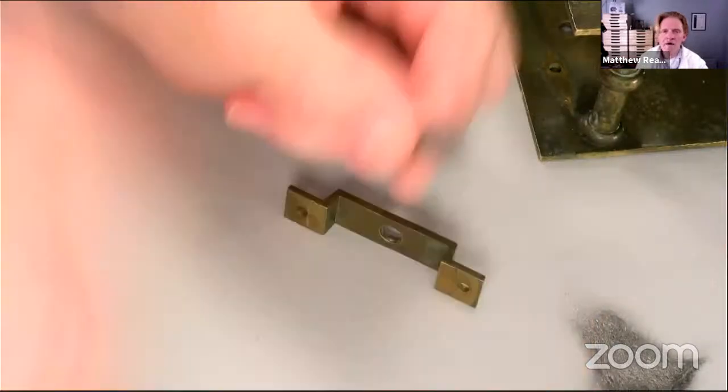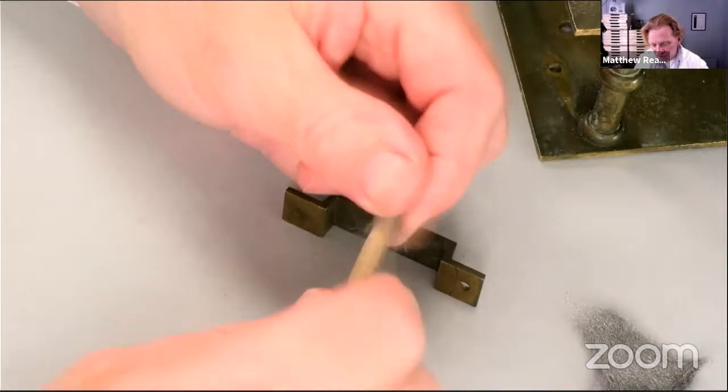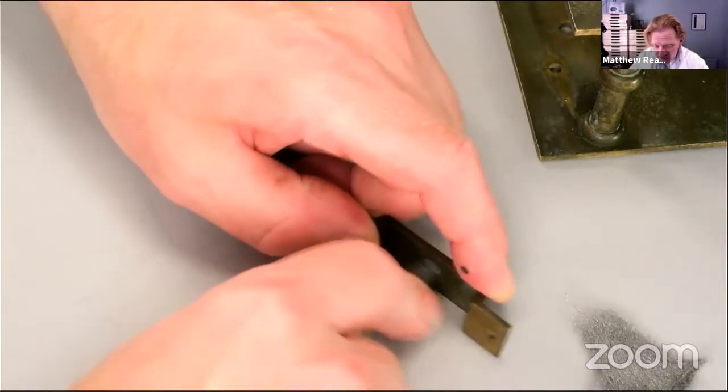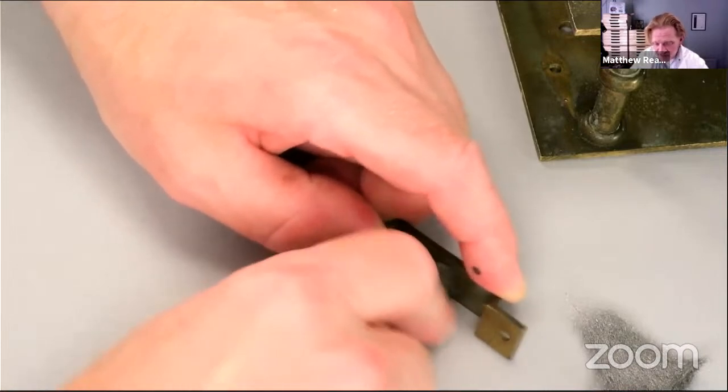Usually it's best to cut this with the scissors. It can kind of break into small fibers. So it's an idea, if you're using it a lot, to wear a mask. It's not as bad as fiberglass, but it can be an irritant if you use it a lot.